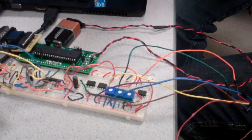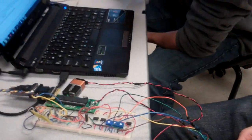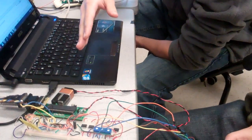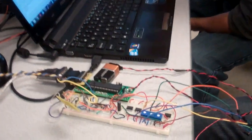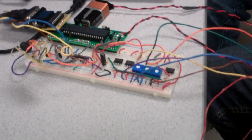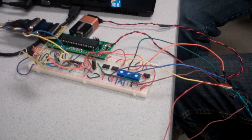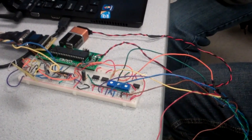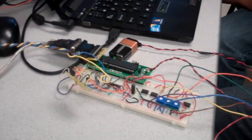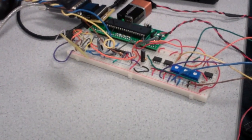Yeah, originally we had some set up for links, basically just to check if it was working. And so we moved away from that towards using the internal ADC on the microcontroller. Okay, so you're looking at the two voltages for the ADC, and the hypothesis here is that as you move your eye, the reflectivity changes because your pupil is a different color than the surrounding eye. Exactly. Okay, right. And what does the wireless do here?